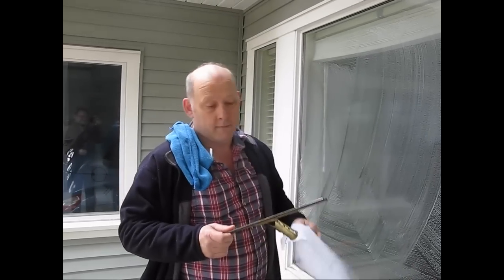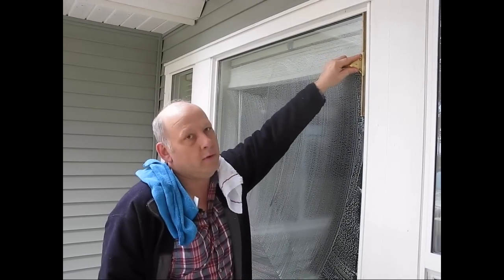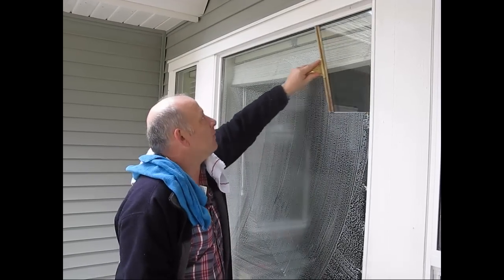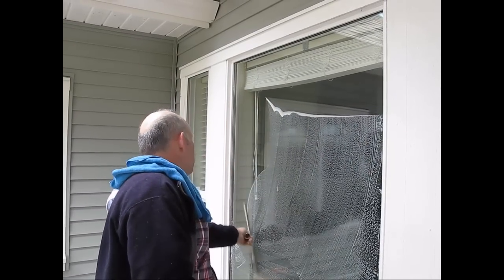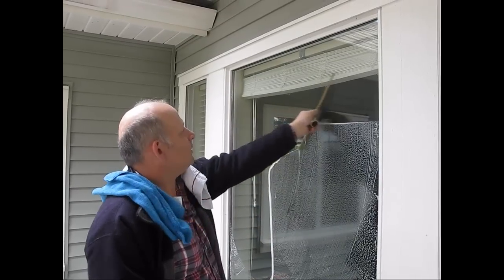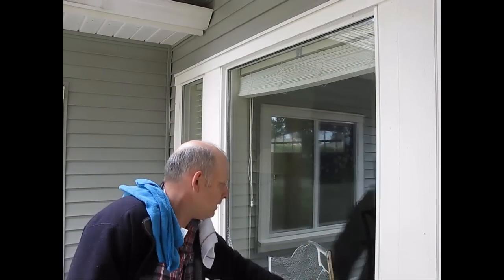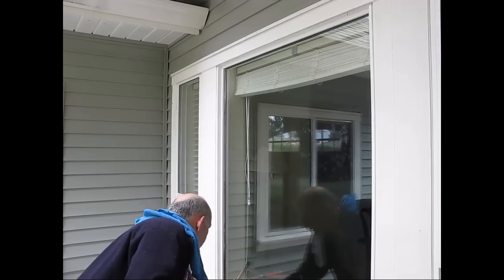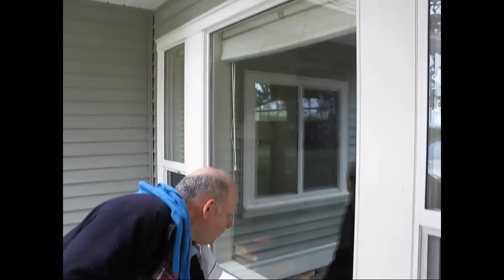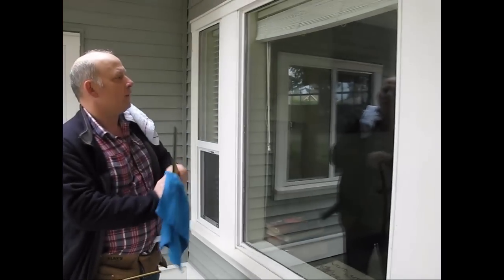Ideally, if you want it streak-free and mark-free, do it in one fluid motion. This is the tried and tested manner: start off in a corner at right angles, come along at the top, and by the time you hit the side you want to be about 45 degrees. Bring it down in a sweep, then scoop your wrist around to collect over at the other side. Then it's a fluid S-shape all the way down, making sure not to miss any. If you do, you can go back up and come back down. Run it 45 degrees along the bottom of the window and then down into the corner. That is the surface of the window largely clean.